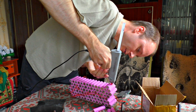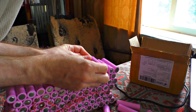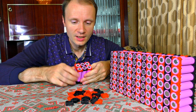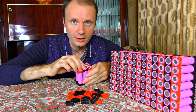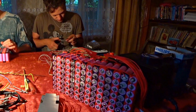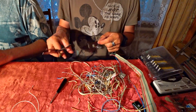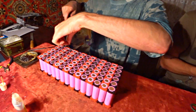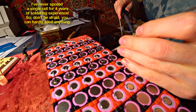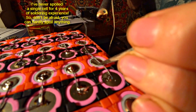You can also use hot glue to fasten the cells — it's reliable but not as neat. There are two ways to connect cells: contact welding and soldering. I use soldering because it's relatively simple and can be done very nicely. Importantly, do not overheat the cells. Welding is not as simple as it may seem and you will likely spoil a number of cells before getting it right.